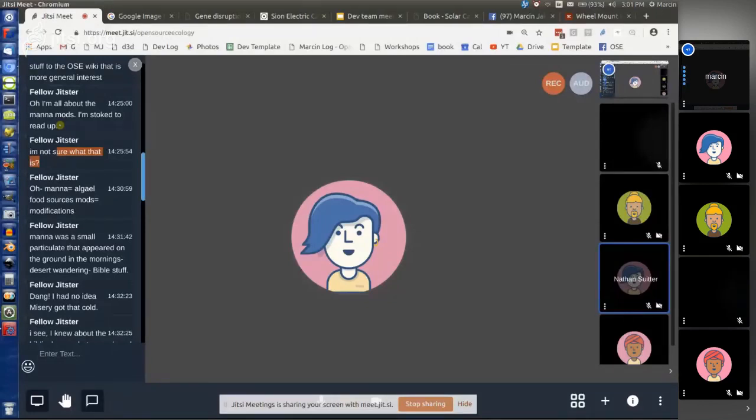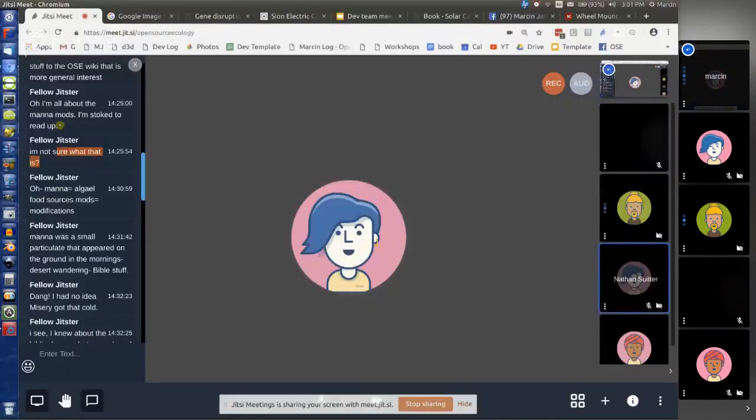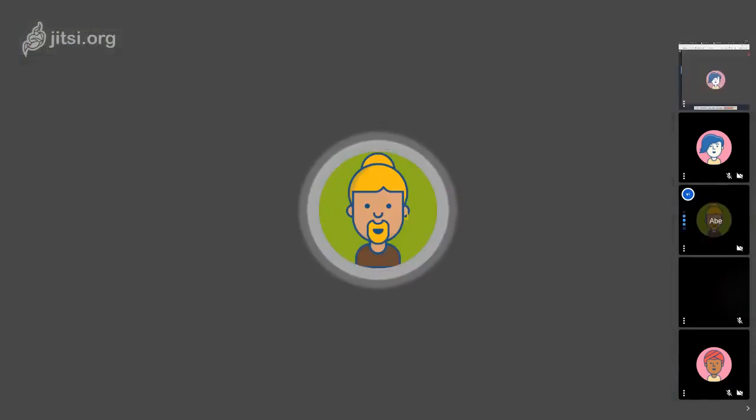So by keeping the code very simple, we just have to put this little delay in there, which is still very simple for a user because it's just delay 50 milliseconds. So there's different ways to do it, but the goal for us is to keep it so simple that a novice user can actually look at the code and understand it just by looking at it. And the definition of simplicity can be different. Say it again. I think the definition of simplicity is going to vary.